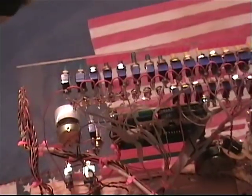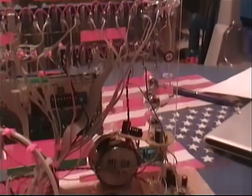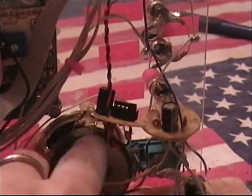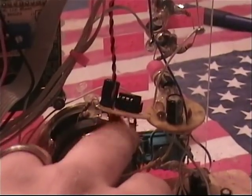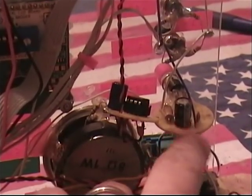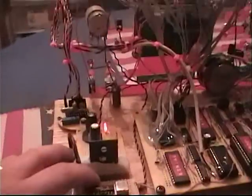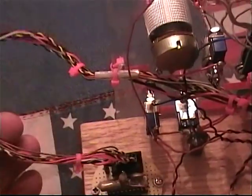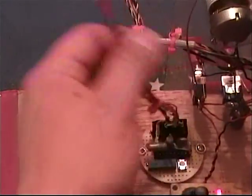The back of the computer — you can see the switches and all the wires. A couple capacitors on board, and a little amplifier built on the speaker itself — I bolted it right to it, an LM386 amplifier. Here's my reset board and power supply board. Here's an analog-to-digital controller board I connected to this port, so I could disconnect it and plug in other things like a keyboard or something else just to play with.